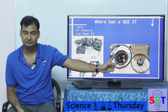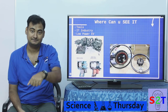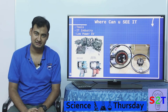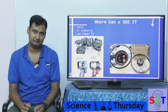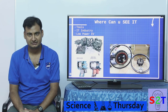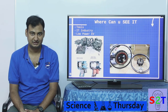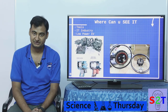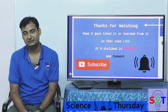Low-power electric vehicles also use BLDC — as shown here, a breakdown of an e-bike where the motor is integrated directly into the wheel hub. These are just a few places where you can easily see BLDC today. Even air conditioning systems are trying to incorporate BLDC into their compressors, though inverter circuits bypass the need in many cases.